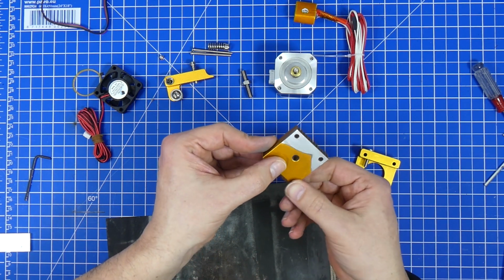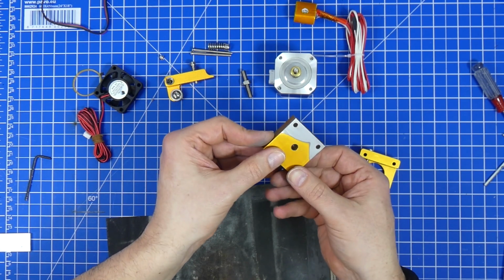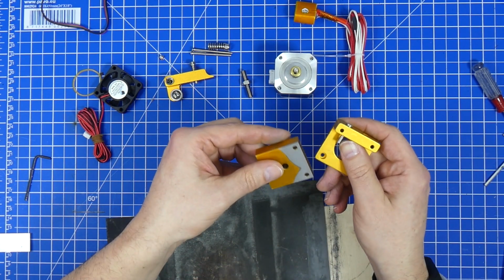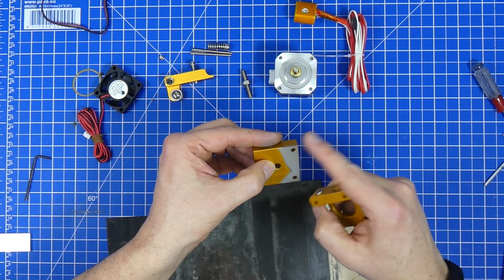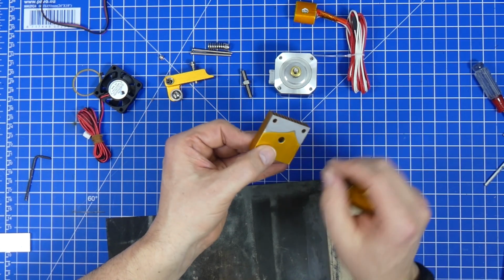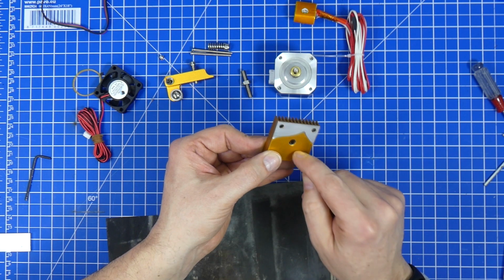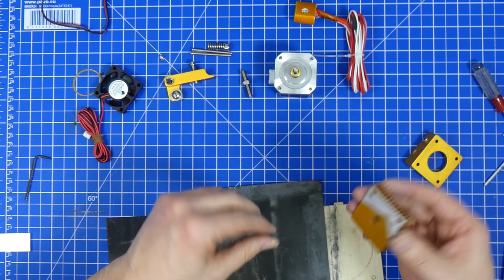So, about 10 minutes later, this is where we are now. We now have about the thickness of the body with exposed aluminium, and exposed aluminium has the best heat transfer capability, a lot better than the coated one. And you can also see that the aluminium wasn't even flat to begin with. So this is about good enough.